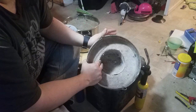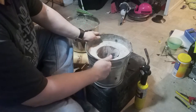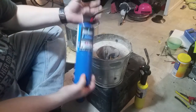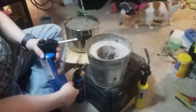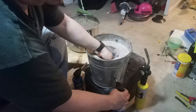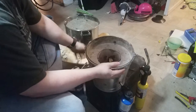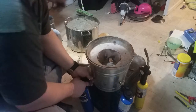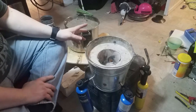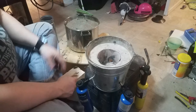It's because of the cooling of the concrete around it, I imagine, that kept it there. After having abandoned charcoal, the way I would actually do the blasting with this now is that I would use just standard propane tanks. I would set up two of them like this in a crossfire pattern, so that when they're going they'll actually come together at a point in there. I've learned that that is actually an inefficient method — you actually want to cause a swirling vortex in there, and that will heat your crucible more evenly and more correctly.